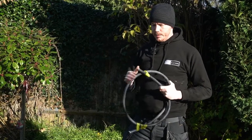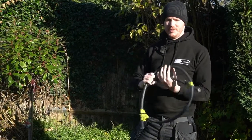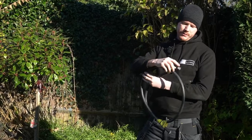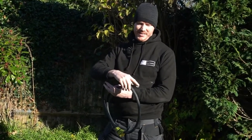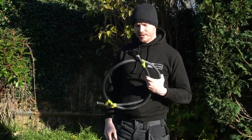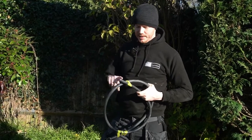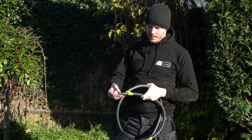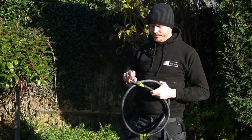The other thing is, what if something breaks the inner core — it wears out, it's got too tight a bend, you're putting too much load through it, and it slowly wears the inner insulation and slowly melts through to the earth. Then the armouring's going to become live, and it's got no function to trip out. If it's on an RCD it hopefully will trip out from imbalance, but if it's not — an armoured cable doesn't have to be on an RCD if it's installed correctly — then this armouring's just live, waiting for someone to touch it, waiting for something bad to happen.